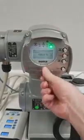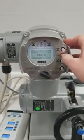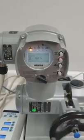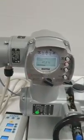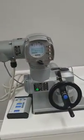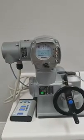Here we can verify that it's been set — the open limit is set. As it travels closed, it shows you the percentage, it blinks in the direction it's traveling, and it stops on its limit. It will also display the position if you're manually operating it, so you always have a live feed on what the position is. When you set these actuators, if this is a modulating application, it automatically adjusts the position feedback and the position command, so you don't have to set all those functions independently. It's all automatically done when you set the limits.